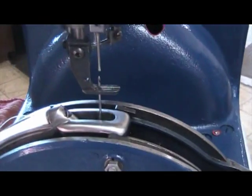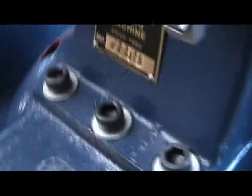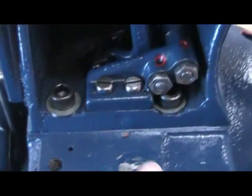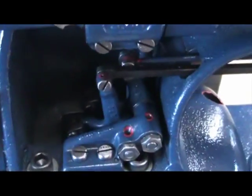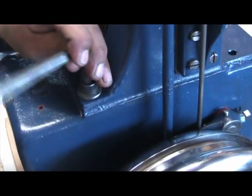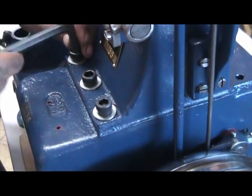The only way to position the awl is to actually set the head position. On the front of the machine there are three Allen screws, and on the back of the machine there are two Allen screws. Everything is easy to access except for one Allen screw. In order to get to it, you have to lift the bell crank assembly up out of the machine, which causes a little extra work. You're going to loosen these Allen screws so you can adjust and manipulate the head. Once you have this locked in place, it's held in tight.